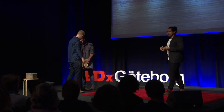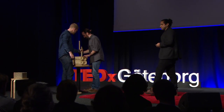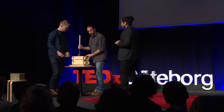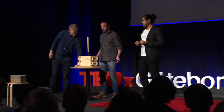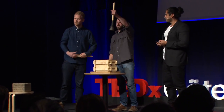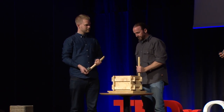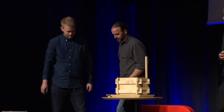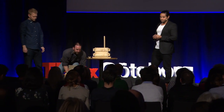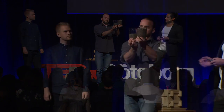There are other qualities with rammed earth, like the layers that you see. The owners of this house said that the layers gave them a calm feeling. And the layers aren't just for looks — they are a result of the process. The thickness of the layers is a result of the rammers you are using and the looks you want. The small rammer is a detailed rammer for the edges, but in more industrialized projects, pneumatic or automatic rammers are used. The important thing when working with rammed earth is that each layer of loose earth should be compacted to about half its original size.